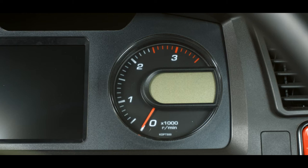The speedometer and tachometer work together in the round part of the machine monitor. The tachometer is a digital gauge design ranged from 0 to 3500 RPM in 100 RPM increments. During certain key-on functions such as manual preheating, this meter unit may reboot with the pointer of the tachometer making one full swing from 0 to 3500 and back again. This is not a failure. The speedometer is displayed in an LCD window within the tachometer gauge and can be programmed to display either kilometers per hour or miles per hour.